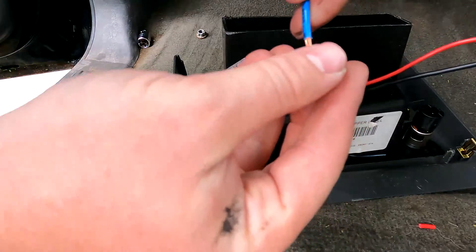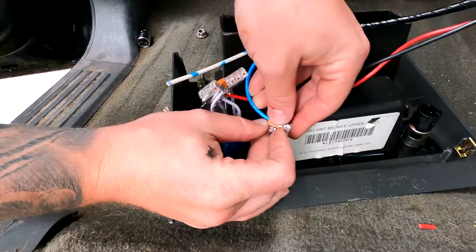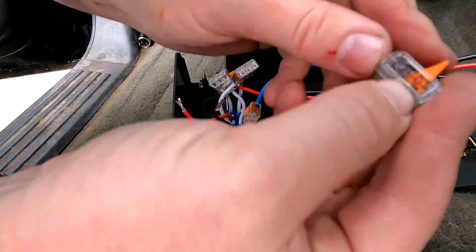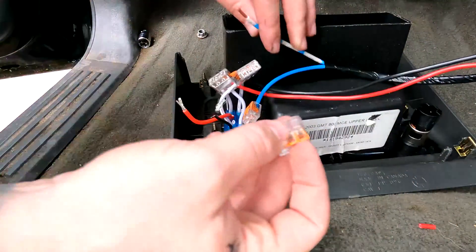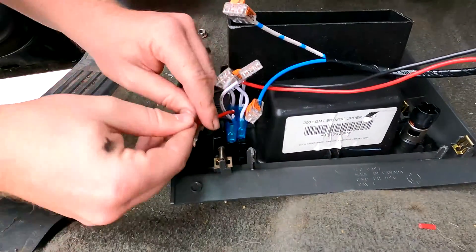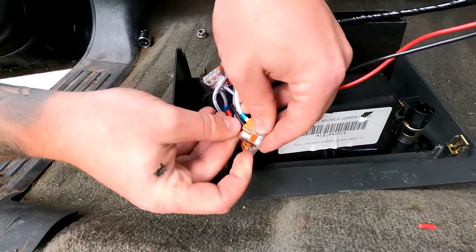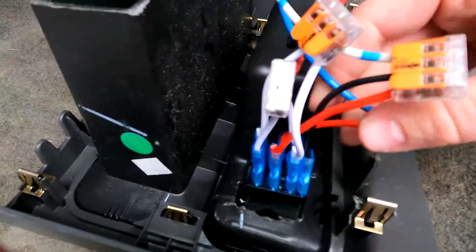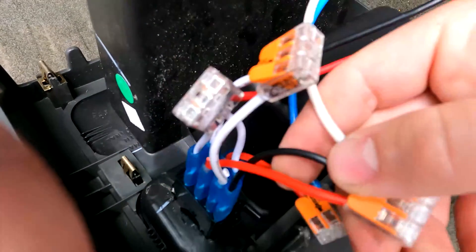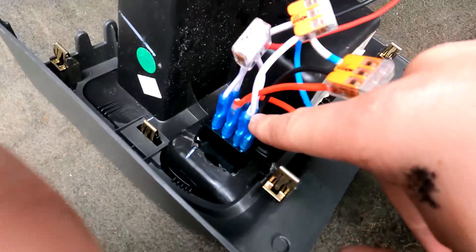These Wagos have multiple ports — this one's a two-porter because I only need two wires going in. It's a good disconnecting means for any type of install, and they go all the way up to five-porters. They're UL-listed for up to 32 amps. This here is my negative wire, and to get the switch light to work I need to hook up my ground wire to it — that's all. So now, you've got your 12-volt hot coming in, your negative ground coming in here, and you jumper one side of your motor leads to both sides of the switch, then jumper the other motor lead to both sides of the switch.